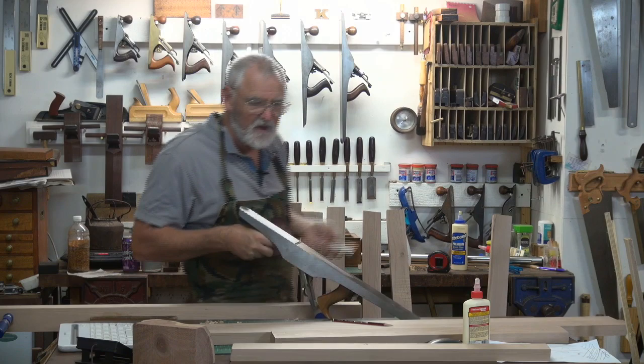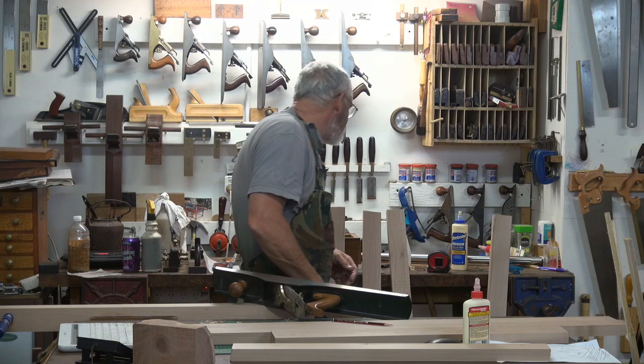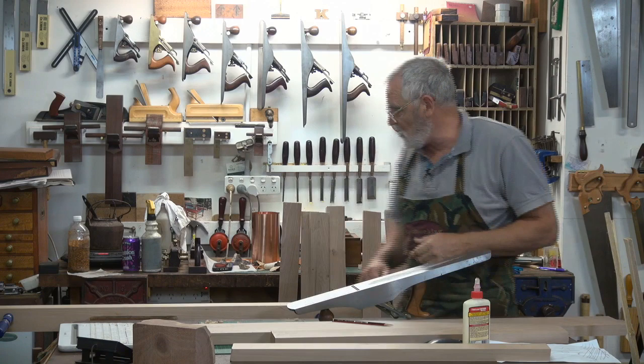The trick, if you're going to use wax, and you're going to glue the pieces together, which I'm going to do here: do not put wax... No, hang on. I did that wrong. I'm all confabulated. You don't put wax on the back, was what I meant to say. I've got a number 8 around here somewhere. I'm going to have to take that wax off, because it will lay wax on the timber and your glue won't be as effective.